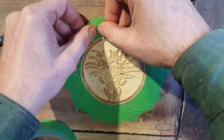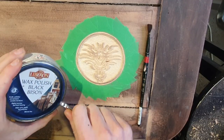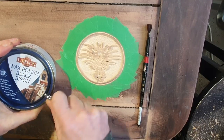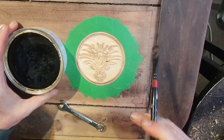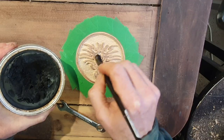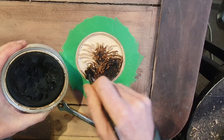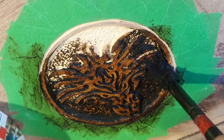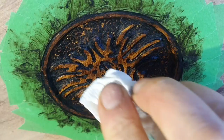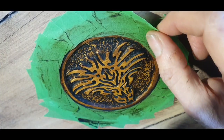So I'm just putting this tape on to protect the outside of the carving from this black wax that I'm putting on. It's actually dark oak wax — it's called Black Bison Wax Polish. Having a bit of trouble getting into it. It smells quite funky but the smell does go away after about three days. I kind of like the smell — anyway, it goes away after three days so it's all good. I don't think it's bad for you but don't quote me on that. What you want to do is work it into those little grooves and all of that kind of stuff and get in there, then wipe it off with a paper towel and it just looks awesome — it looks antiquey, looks Viking-like.